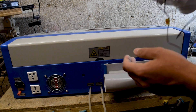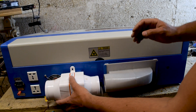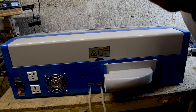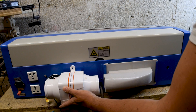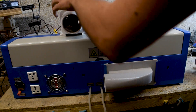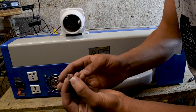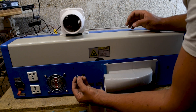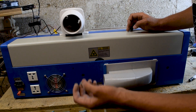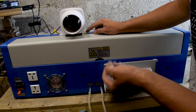The only thing we have to do to modify the case is to mount the motor, which is going to go right here. Since there's nothing behind the sheet metal I'm going to mark the hole position and start with one hole. I'm going to use M4 screws and just try to tap this thin sheet metal, which is probably a silly idea because I only get about half a thread. But it's not going to have to hold a lot, and if it comes loose I can still attach a nut on the inside.